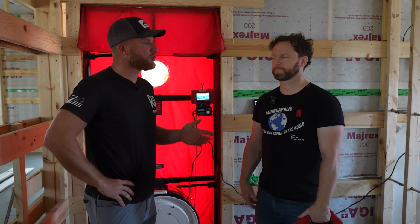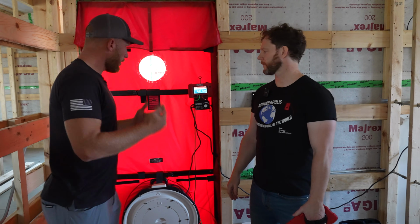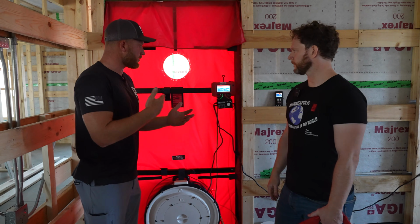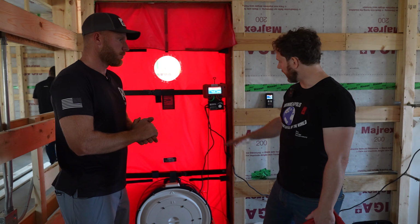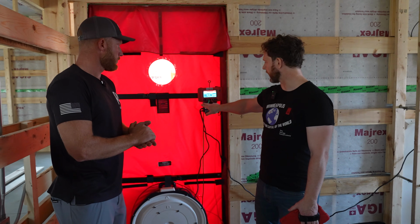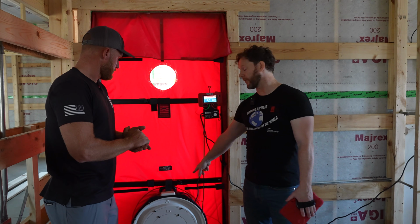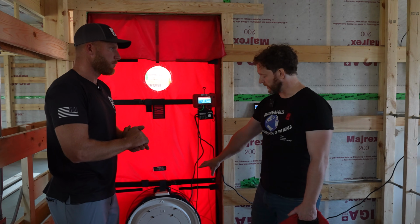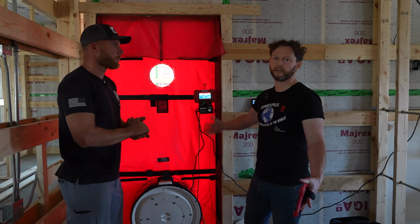All right, like I said, this is Jake. Jake, thanks for coming down. No problem, first time we met. Tell me exactly what you got going here and give us the lowdown on what you're going to do. Cool. This is the Minneapolis Blower Door system. It uses a 2-channel manometer here, very accurate to measure the pressure between the house and the outside. And the second channel here measures a pressure down in the fan. And we convert that with the size of the ring to a flow. So we can use this to measure how leaky the building is.